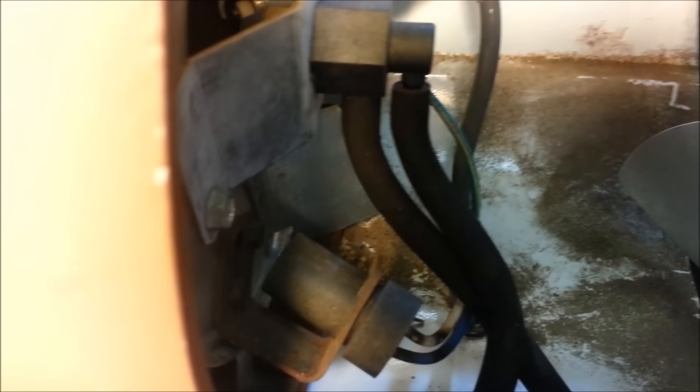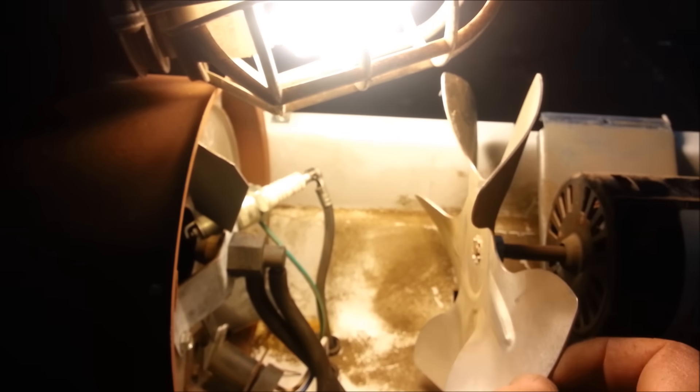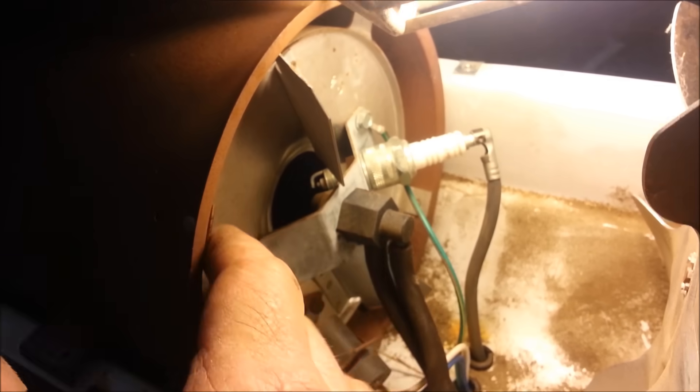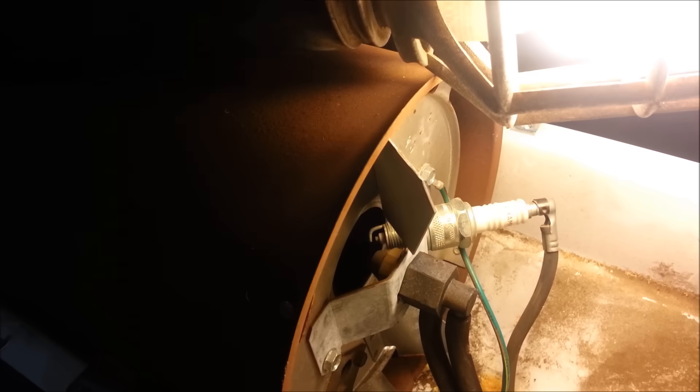You'll see them come right up to this little manifold. What happens is, just like when you're blowing over the top of a straw and the fluid comes up — the exact same thing happens here, a venturi effect. So our air is coming up, pushing through there and blowing in. The process of blowing over an orifice in here is pulling the fuel up and squirting it in through this little nozzle right there, and the spark plug is igniting at the same time. The fan is blowing air across there, around the housing — because this is all sealed — adding oxygen to the fire and pushing it out.